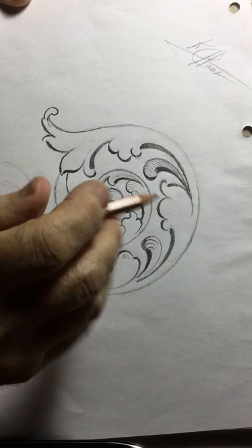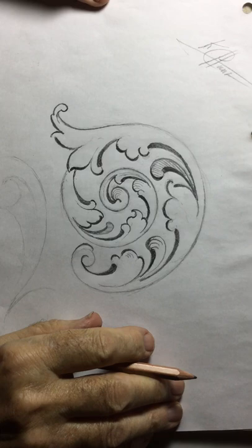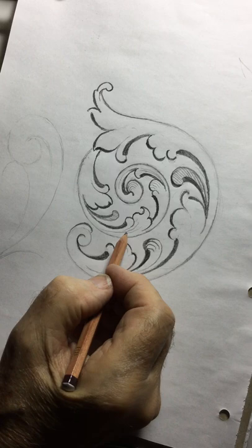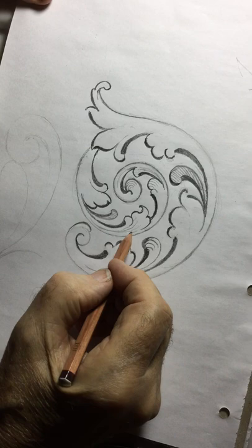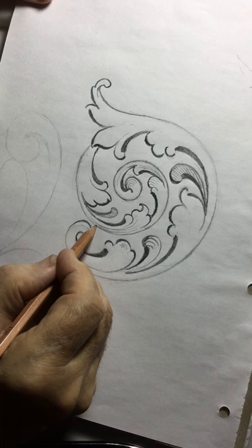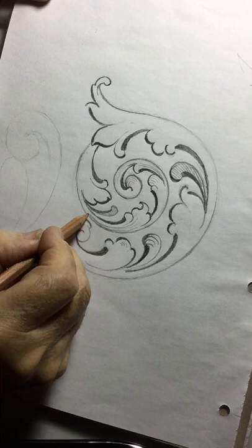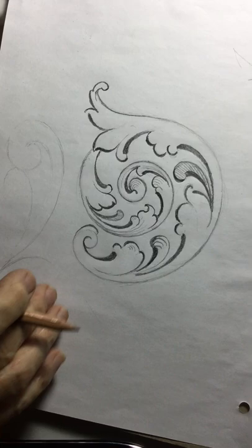Try to make the variations in shadows with fine cutting like so. Because it's large, I'm just doing it as though we are going to shrink it. Here you would maybe put a couple of bits in. So now I would be shading back into this here, and around here. Because this is open work, we could shade to the back of this, to make this a little bit darker — as though the sun is shining here and coming from the back of the scroll. But we're leaving this here light. If you've got good cutting and it's small, you could almost leave it as it is.